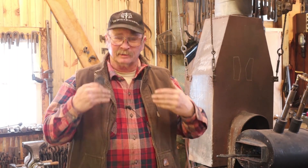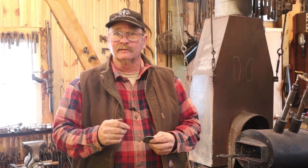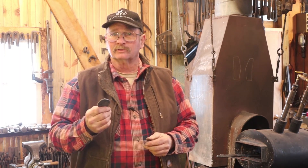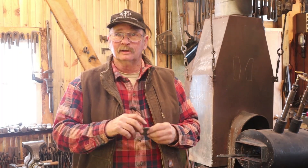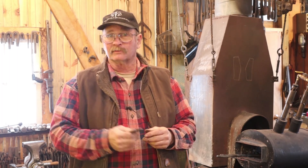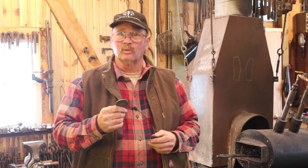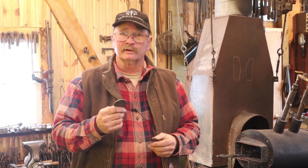In any case, we know that this is not a high carbon steel. It's not going to make knives, it's not going to make good chisels, probably not going to make very good punches — but maybe. It might be something close to 4140, might be something close to 1045, maybe something more like 30 points of carbon instead of 40 points, and that might be fairly accurate. It wasn't too far off the spark pattern for the 4140, but 4140 is an oil hardening steel, and this definitely didn't harden fully in oil. It got harder, but not as hard as it did in water, and it certainly didn't get brittle in water, so I don't think it's an oil hardening steel — I doubt that it's 4130 or 4140.